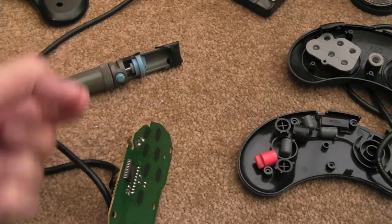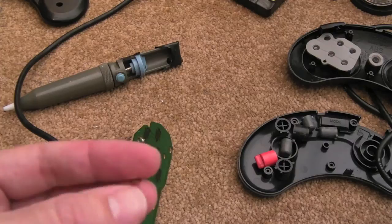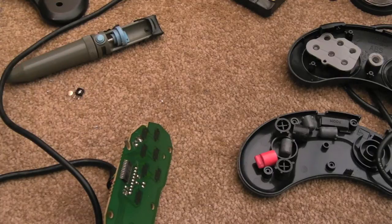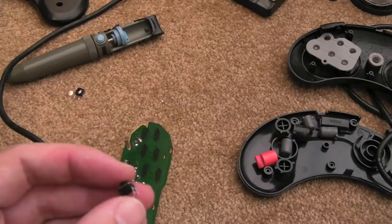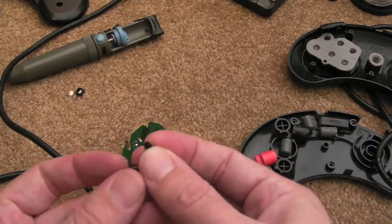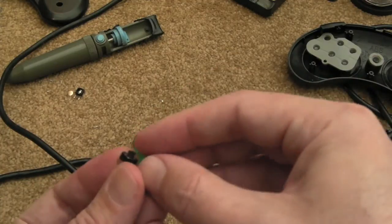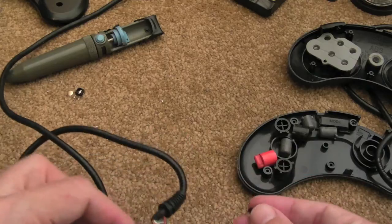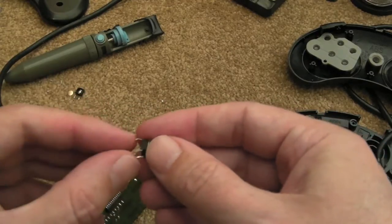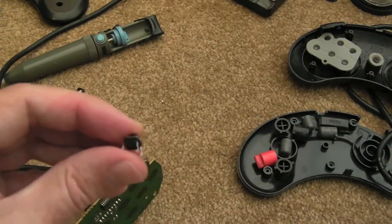You can see this thing has just fallen to bits completely. I've got the little internal piece — I'm going to keep that because you can use these in other systems like the Neo Geo controller, so that's a useful spare. And I've got the little micro switch there — it was a bit bigger than that, one of these ones that came up about another couple of millimetres. I've got the bit chopped off here — I chopped that off with a Dremel and then melted it down a little bit with the soldering iron just to get it the right size. To fit one of these, since they go that way up, you just bend the pins down with pliers so they're straight down instead of 90 degrees out.